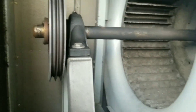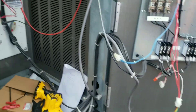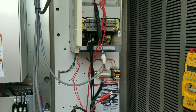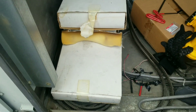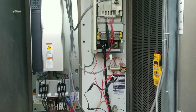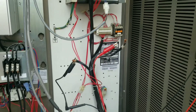I don't feel anything in the bearings over there. Belts look in okay condition - fairly new. I'm not sure about this VFD, but this one's been replaced. I'm assuming I've got a problem with this VFD not giving me any output. My next step, only because I have it, is this module here. This is kind of a ghost town of parts in this unit. I'm going to swap one of these modules out and see if we can't get the alarm to go away and get this motor to run.